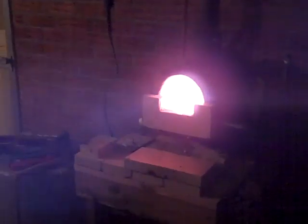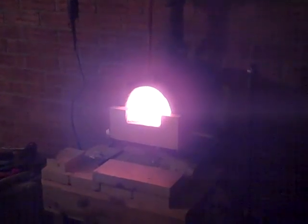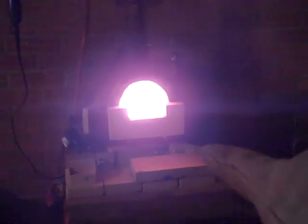There it is — it's doing its final bake. On camera this looks a hell of a lot hotter than it really is in person. It's a light orange-ish yellow glow in person, which means I can get it a lot hotter than it is right now. But now I've got the Satanite in there lining it. It's got a pretty even heat all through the whole forge. I'm still going to put a sacrificial fire brick on the bottom to keep from scraping the clay coating on the inside, but I am glad I spent today doing this. Thanks for watching.